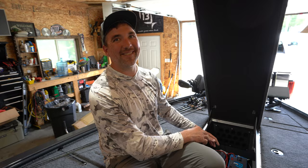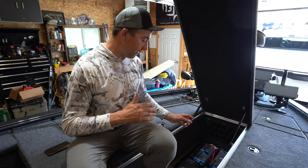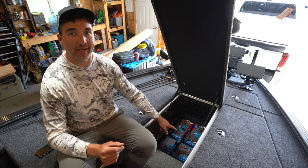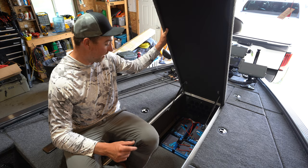It's tons of power. I've got five big graphs on this boat that are all power pigs, and I'm not going to have any problems there, especially with the run-and-gun charging system. This boat has three battery trays up front preset for a 36-volt system. By going to those two 36-volt batteries, I freed up extra space for this 16-volt battery — took a whole battery out of the boat. Now I can have this big power pig up here with direct runs to my front graphs using the factory power harness right into it. That is the absolute best way to go about it, and just another reason those 36-volt batteries are helpful.